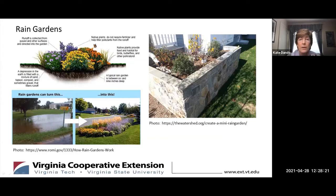Ideally, the rain garden is sized to accommodate the amount of water coming off your roof and other hard surfaces, but any steps you take will be helpful, so even a small rain garden will help dry out your lawn, improve water quality, reduce the impact of stormwater on the county's streams and rivers, and provide food for pollinators. To build a rain garden, you should remove the soil down about 12 inches. The soil at the bottom would then be amended with about 50% sand and compost to improve drainage. It is also a good idea to add an underdrain to handle overflow from the largest storms. Easy-to-follow instructions are in the Rain Garden Design and Construction manual on the Fairfax County Soil and Water Conservation website.